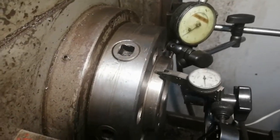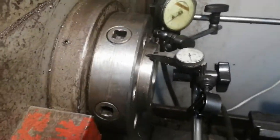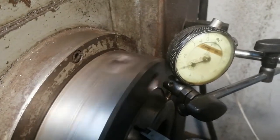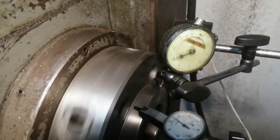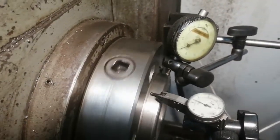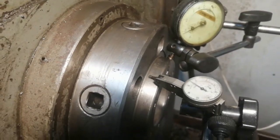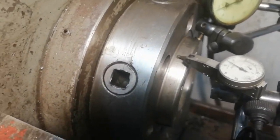I'm using an extra indicator for the front and a little one for the back. As you can see, both indicators are jumping around quite excessively — but remember, this is a tenth indicator and this is a half-tenth indicator. So there is definitely more roughness, and some possible run-out in the amount of maybe plus or minus two tenths. The rest is hard to determine due to simply pitting in the actual spindle nose.